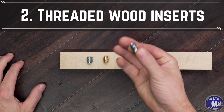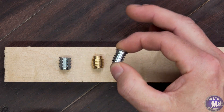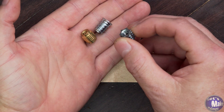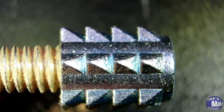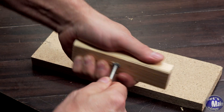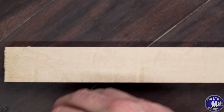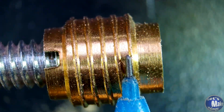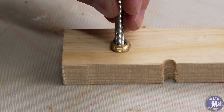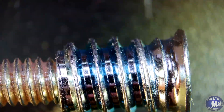Another way I like to make knobs is with a threaded wood insert. If you're in a pinch and need to crank out a bunch of knobs, this is a fantastic choice — it's fast, repeatable, and clean. That said, there are three types and it's important to skip two of them: the barbed ones and the brass ones. Barbed inserts need to be hammered in place, and if bumped from the opposite side they'll start to work themselves loose — they will pull out over time, especially in a knob you're constantly loosening and tightening. The brass ones have narrow shallow threads meant to be epoxied in, not screwed in. Epoxy takes time to cure, it's messy, and there's still a chance they fail. The kind I use have aggressive self-tapping threads that really bite into the wood and grab on tight.